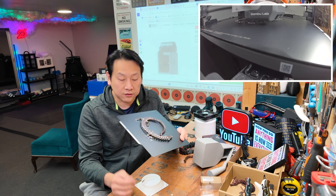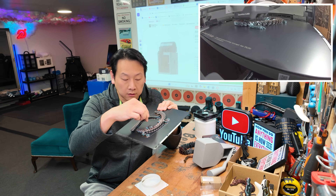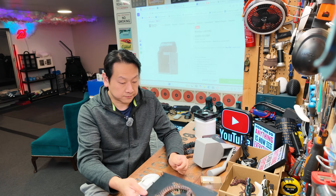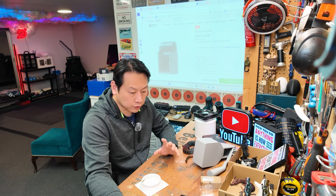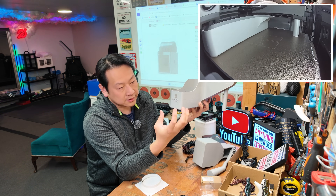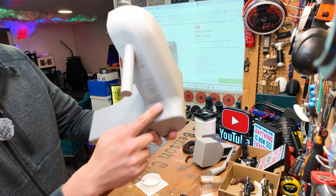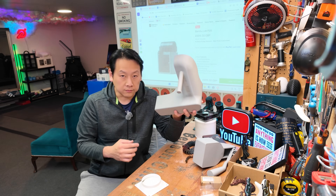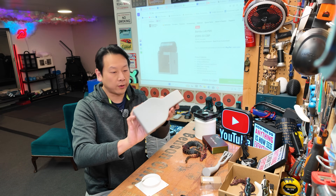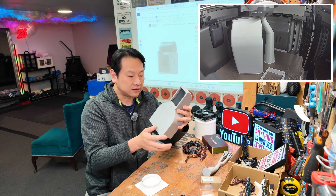For smooth plates, there will be times you need one, but you do need a brim — especially when printing small parts with a tiny footprint but a massive build on top. This is a failed print with a 0.2mm nozzle. With the 0.4mm nozzle I had a lot of problems: overhangs had chunks missing, and when using tree supports they'd end up pulling out all the small parts as well. You can see where it comes to the slope and overhang it really messed up — but it still completed the model. When I changed to the aftermarket nozzle — I'll put the link in the description — this one came out almost perfect, still with some defect lines but close to the optimum setting for speed.